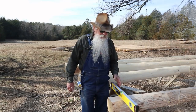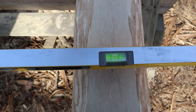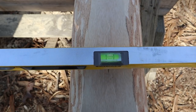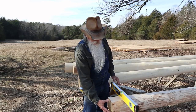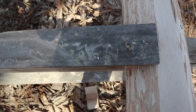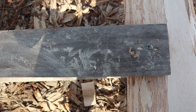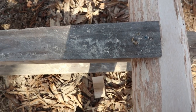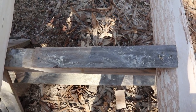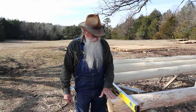I've got the joist up here. I put a level on it about where the shoulder will be on the end of the tenon, and I checked to see how level it was on either end. I had to twist or cock it just a little bit back and forth, but when I got it level I locked it down to the sawhorse with a clamp, which is working like a metal log dog would — except with a log dog you're hammering and it's hard to keep everything still.